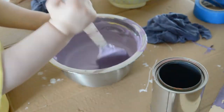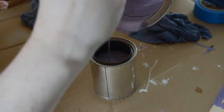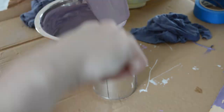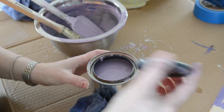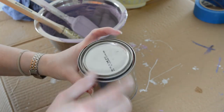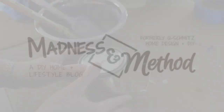Once you're sure that everything is mixed thoroughly and there aren't different colors or any chunks, you can go ahead and pour it into your container. Just wipe up any messes, put your lid on, and then label your new can of paint. Before you use it, you are going to want to give it a stir just in case any of the colors have separated while it's in storage — but that's the same thing with any paint.